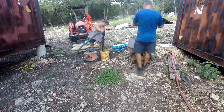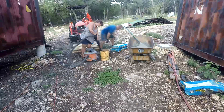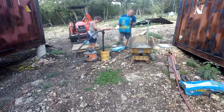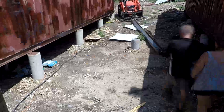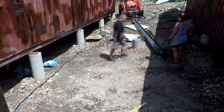When we're doing the concrete work, we always vacuum the holes out to remove all the loose gravel and everything, level out the sonotubes, and then start filling them up. The W8 beams are 300-something pounds, so we actually just kind of pushed them into place with the tractor.